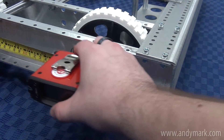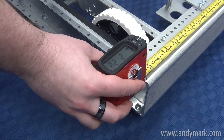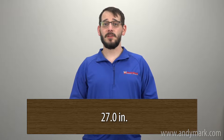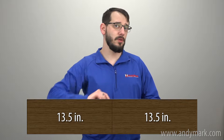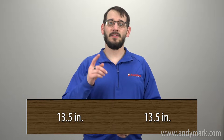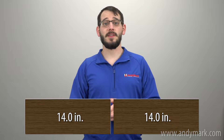Since we've decided on a full wrap of two C-shaped halves, we're going to make six planks for each bumper color — two long planks and four short planks. The long side is 32.25 inches; we'll cut four planks at this size. The shorter pieces extend past the long pieces to add corner strength. The narrow side measures 27 inches, halved to 13.5 inches. We'll add 3/4 inch to cover the long plank and subtract 1/4 inch for a gap between bumper halves, giving us short planks cut at 14 inches long.